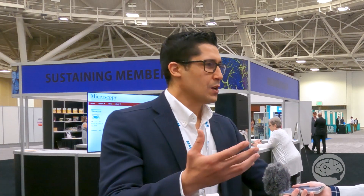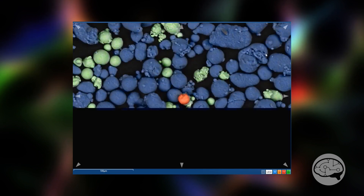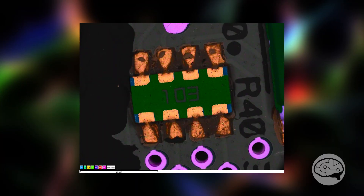Sure. With Unity we introduce a new technique for SEM called BEX — backscattered electron and X-ray imaging. As we all know, in SEM for a very long time the imaging was in gray level, mainly secondary electrons or BSE signal, which gives some indicative information about what's there, but we don't really know what's really there until we do some EDS analysis to see the elemental information. With BEX we get all that information live, on the fly, while we move around the stage. It's basically converting the gray level image to a colored image — but colors that mean something — so we can immediately see the elements existing on the sample. It's really changing the way people use SEM on a daily basis.